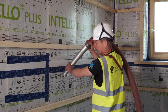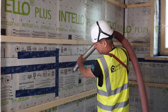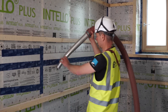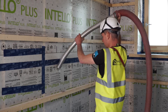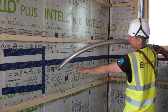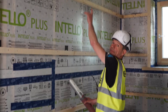Another detail I like about using the needle is I can really go exactly where I want to go. I can pull it back a bit, go to that corner again, go over here again. I can place the cellulose perfectly wherever I want it and get a really good and fairly even density. Now I fill it almost up to the hole, then flip it around and bring it all the way up and start filling from the top down.